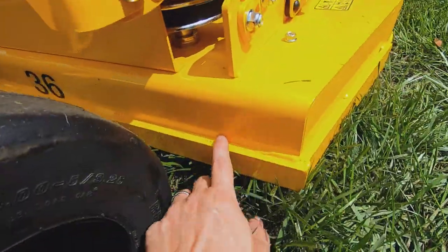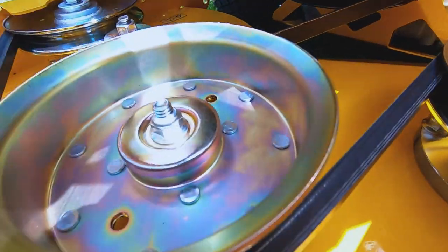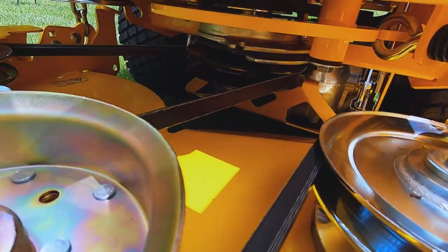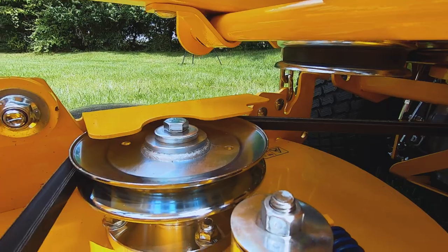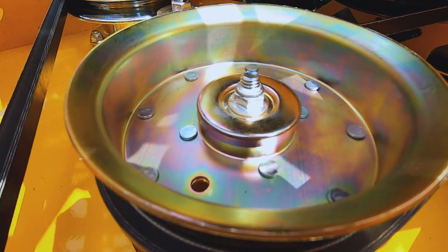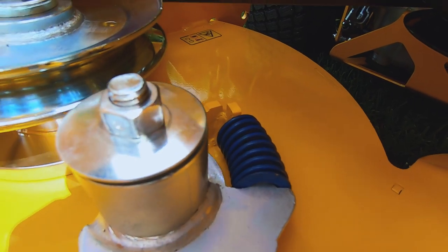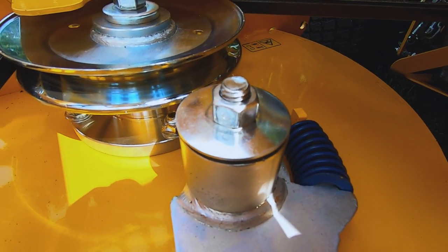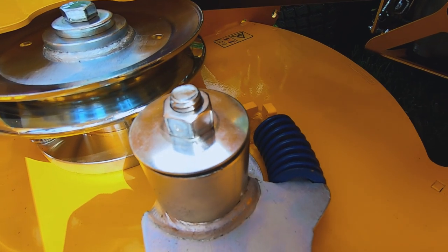The deck has a heavy-duty reinforcement bar on it. Looking inside the deck, you can see the clutch, the idler, and the main belt which first goes to the discharge side, pulls around here, then in the front goes to the trim side pulley. Then we have the tensioning idler. A lot of our tension idlers have this die spring setup. The arms are on ball bearings — these just almost last forever and keep a nice steady tension on the deck.